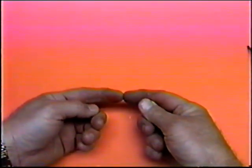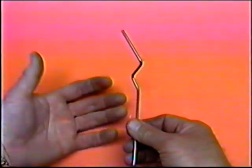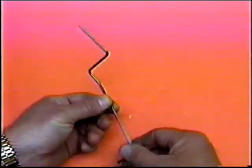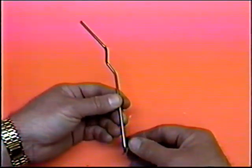Now, before I do that, I can do two things. I shortened the screws to the minimum length, and they're aluminum screws, not steel screws, so they weigh less than half. And all these little things like the aluminum screws, believe me, when we weigh the final model, you'll see it really adds up. It'll make a difference in the final product.